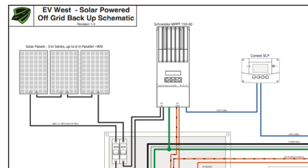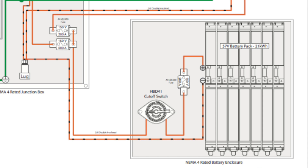From the charge controller, power goes into the battery packs — a 57-volt battery pack, 21 kilowatt-hours as pictured here. Michael has a bigger one: 11 modules instead of the seven modules pictured. His system is a bit bigger, but what's drawn here is the smallest possible configuration you can use. Of course, those are the 57-volt smart Tesla modules that Michael sells on his website.